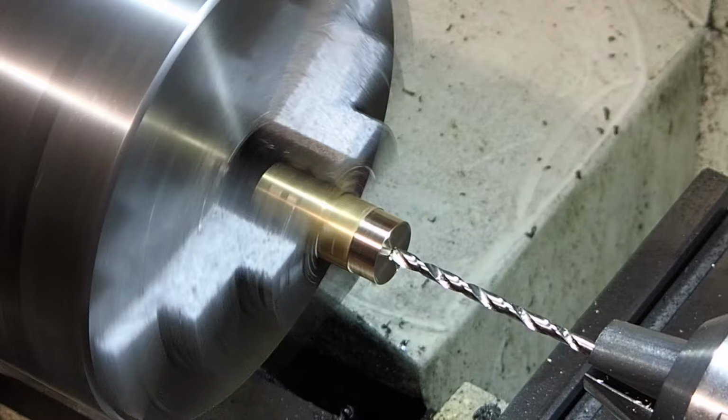They're made out of a 1/4-inch silver steel threaded with an M6 thread on the end. These still need to be hardened, and they also need a screwdriver slot cut in the end. Now I think I made a bit of a mistake with these two. The drawings show the thread overly long, and I originally thought that was a mistake on the drawing, so I've made the thread just long enough so that it's flush with the side plate.